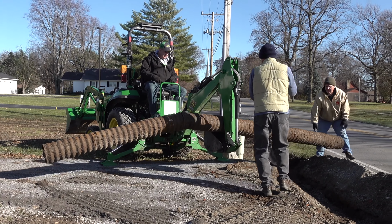So we're gonna make sure that we get that culvert where it just catches all that water and is essentially level this way because we don't have much slope even toward the camera there. And then we're gonna dig out a little bit of that ditch. Up here, it's probably okay, isn't it? You think, or do I need to dig some up here too? Yeah, I think we need to start up here. Okay. Just to clean it out.